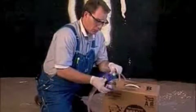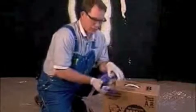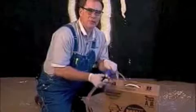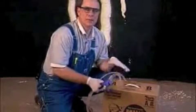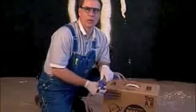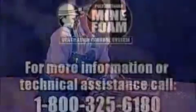Over a period of time, propellant will leave the hoses and the material may become very sludgy. And so it is very important that every week you spray and purge the hoses for a few seconds to keep fresh material in the hoses. That way your kit will last indefinitely with only a minimal loss of material.